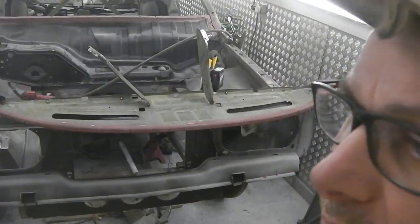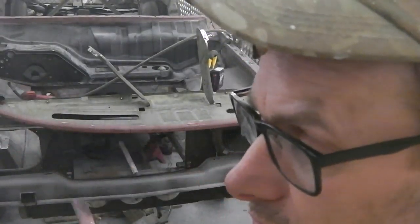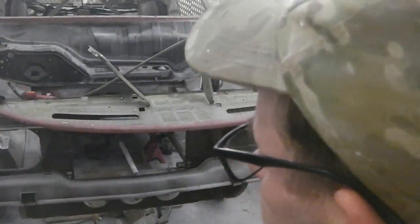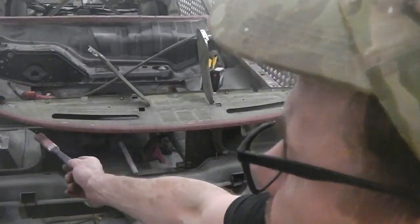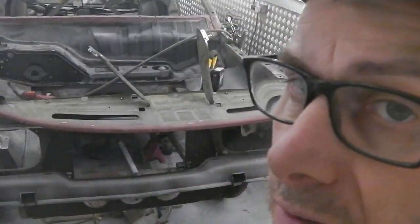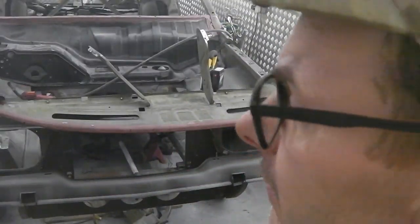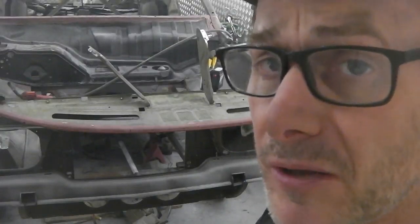And when you are doing repairs like we did on the front end, it paid off because it's so nice to get the butt welds together on those and the lap joints on the legs. And whatever remaining metal we kept, the slam panel in the middle, for example, made good clean lines. No one had to grind paint off and have fumes. Oh, that's another thing. Fumes are minimal. I thought I'd be struggling here.